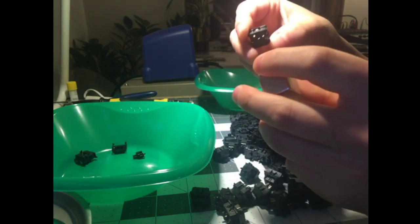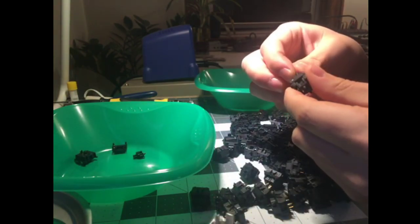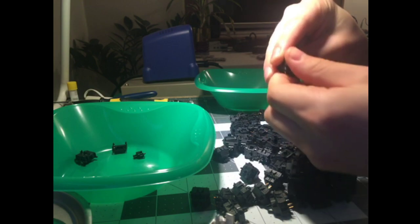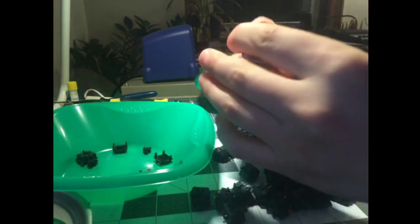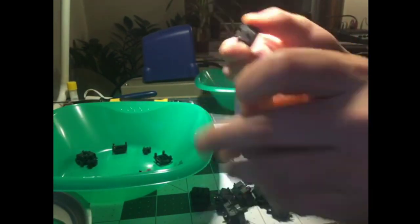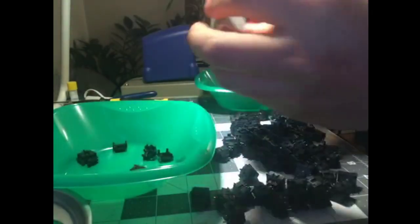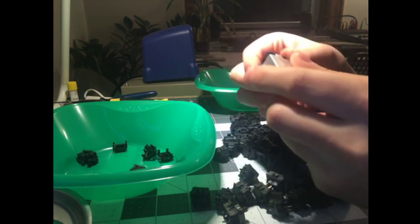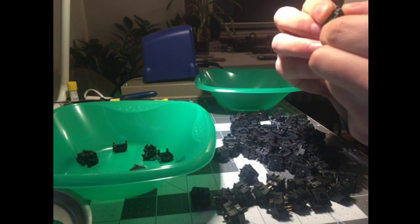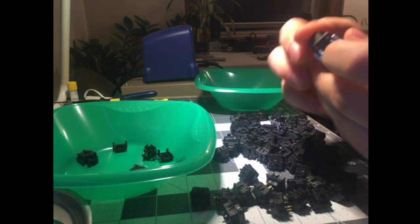But the less you bend them, the less wobbly your tops are going to be, which will give a better sound and potentially less wobble. And yeah, Cherry switches especially are susceptible to it. That's absolutely true. So yeah, what I like about this is you can just pop it down and it cracks. It doesn't go all the way through. But my technique is a little different. So I'm trying to show you how it works. But normally, let me see how I would do this normally. Yeah, I guess I would use that. Do my thumb. And you get a feel for how far is too far too. You can pop the top back on and it doesn't really wiggle. That means you did a good job. If you pop the top back on and it's markedly looser than it was before, then you overdid it.